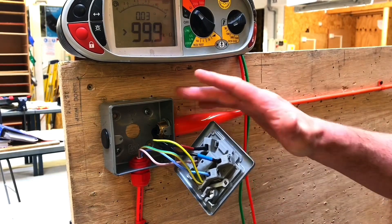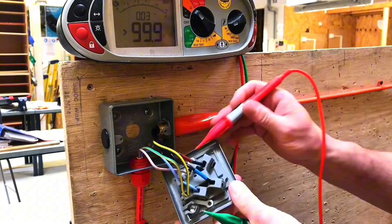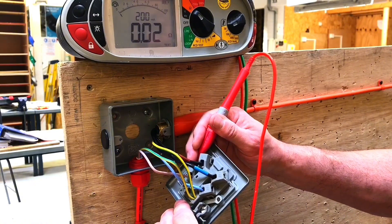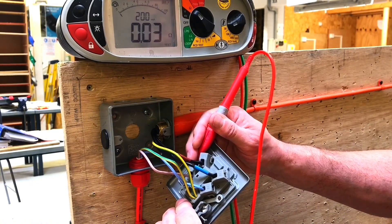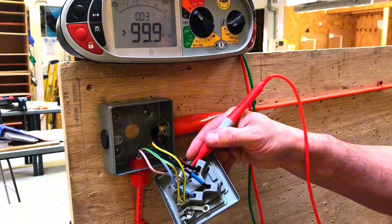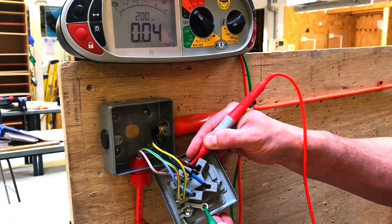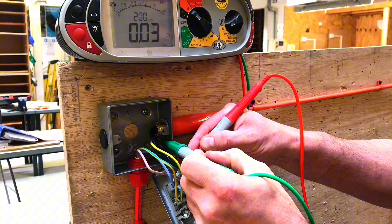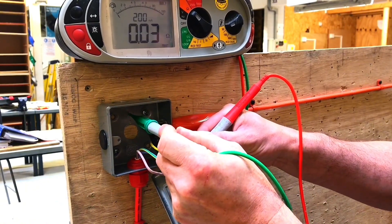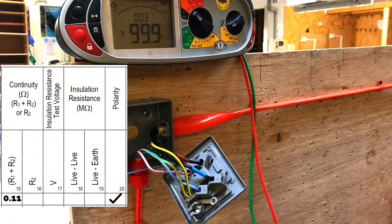I've come back to the fuse connection unit, which has a metal back box and a metal front plate, which are exposed conductive parts. I'll go onto the line conductor and onto the CPC — a reading of 0.03 ohms. I'm also going to test to the front plate — that is connected to the CPC, front plate 0.03, the conductor in the back box 0.03, and the metal back box itself physically 0.03 as well. Of all the readings I achieve on the radial circuit, I'll record the highest one.